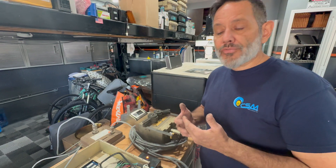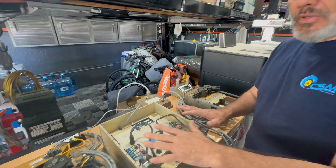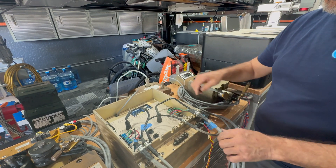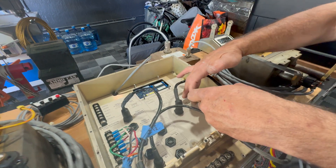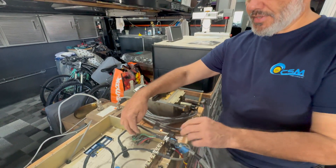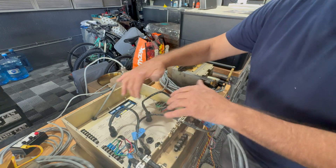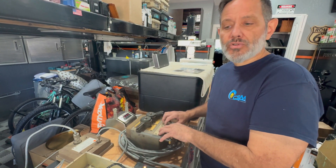But we're going to go a little bit further with an extra step. What we're going to do is determine if it is actually the actuator or if it could be in the processor. So we take the starboard side feedback harness — this is the feedback harness with the plug. The barrier strip has your throttle motors, shift motors, and solenoid. The orange and blue is for your solenoid. The red, black, white, and green are for your motors. We're going to shut down the system, take all the wires off, and swap from the starboard side to the port side. If the problem moves to the other side, you know the problem is with the actuator. If it stays on the same side, it is most likely a bad processor.